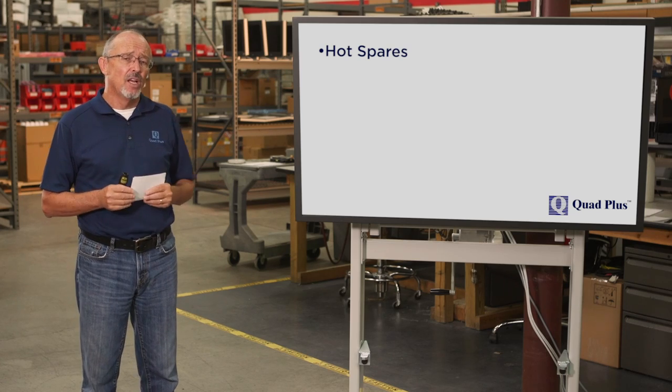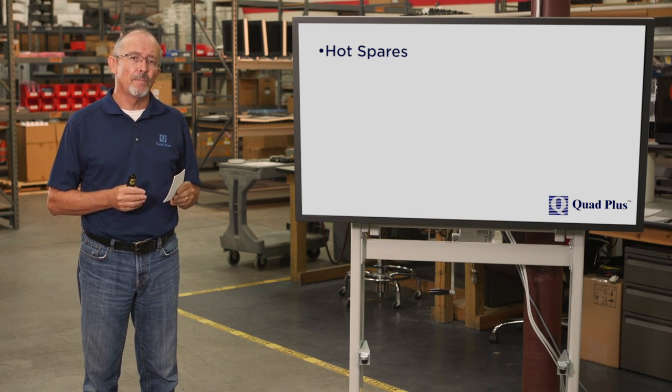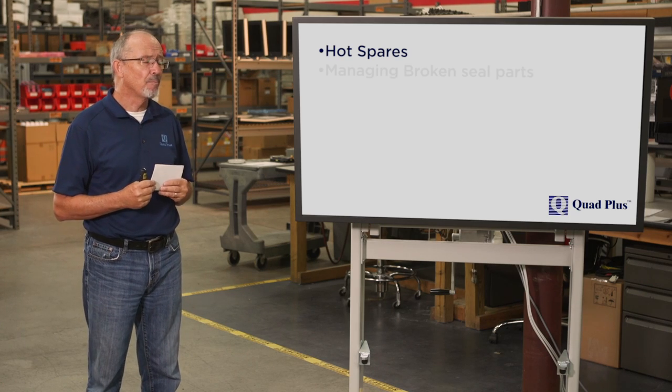So let's start with the maintenance processes, hot spares. On a number of occasions I've seen customers where we'll be out on a site doing a startup, and as soon as we're finished, the first thing they do is come into the room with all of their spare parts and say, okay, install these. I think it's an absolutely great idea. You have all of the manufacturer's reps on site, you've validated that your spares are good, and the parts that you've taken out, you now know are not only configured, but also tested and operational. So you have a very high level of confidence in their ability to perform.